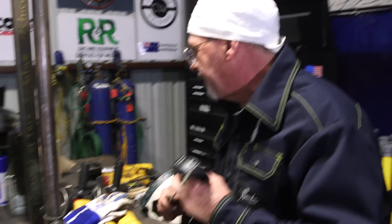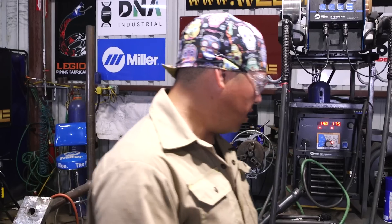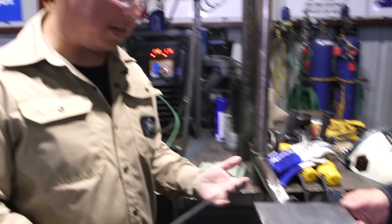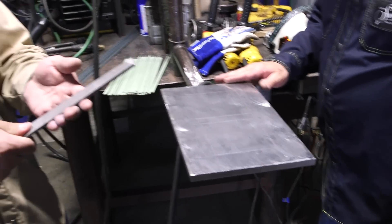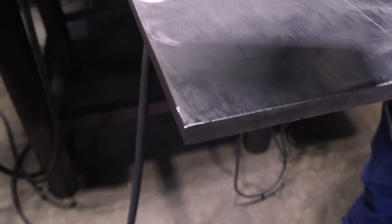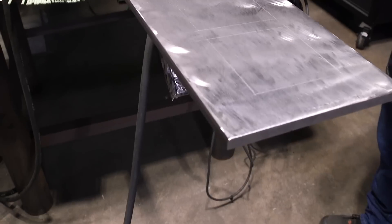We're going to run some stick first. I got a file right here — that'll kind of give us an idea of how hard it is. This is already hardened steel; this should tear into our plate very easily. Oh yeah, it's dug right in. So if this is done correctly and it's got the right chemistry, the file will just kind of float over the top and won't bite into the hard facing. It shouldn't.